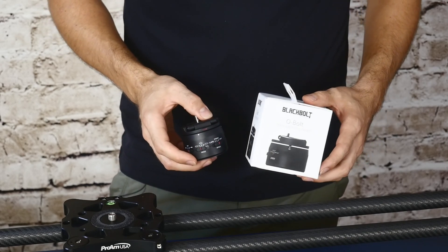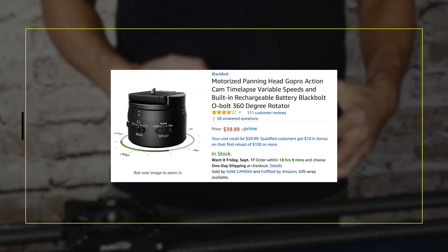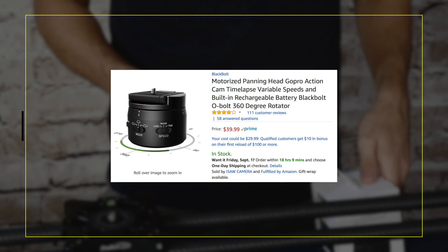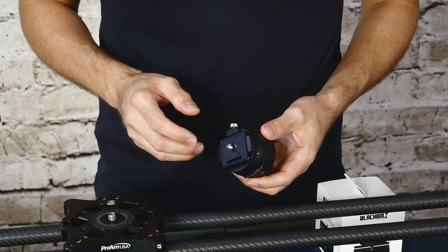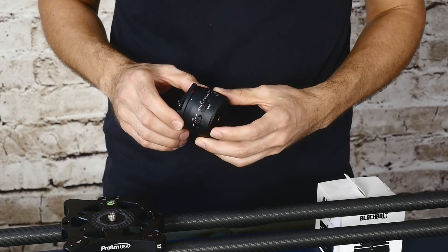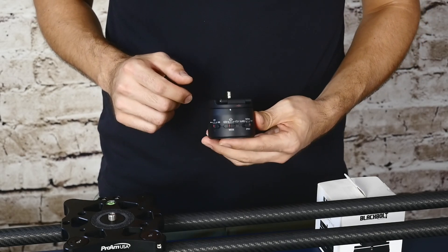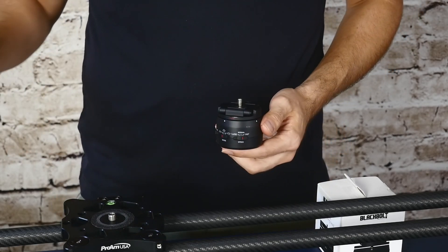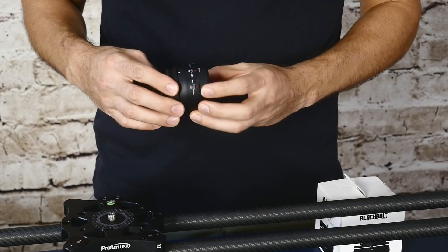This may work with a variety of motors, but the one I chose is by Black Bolt — it's called the Obolt Mini Panning Head and you can find it for 40 bucks on Amazon. I'll include a link in the description below. The reason I went with this one: it's not really that heavy duty, so you may not want to use it on the platform unless you're mounting a GoPro. The key is that it's able to rotate continuously 360 degrees, which is necessary to move the slider platform all the way down the rails — the motor needs to make many revolutions to do that, and this was the only one I found that could.